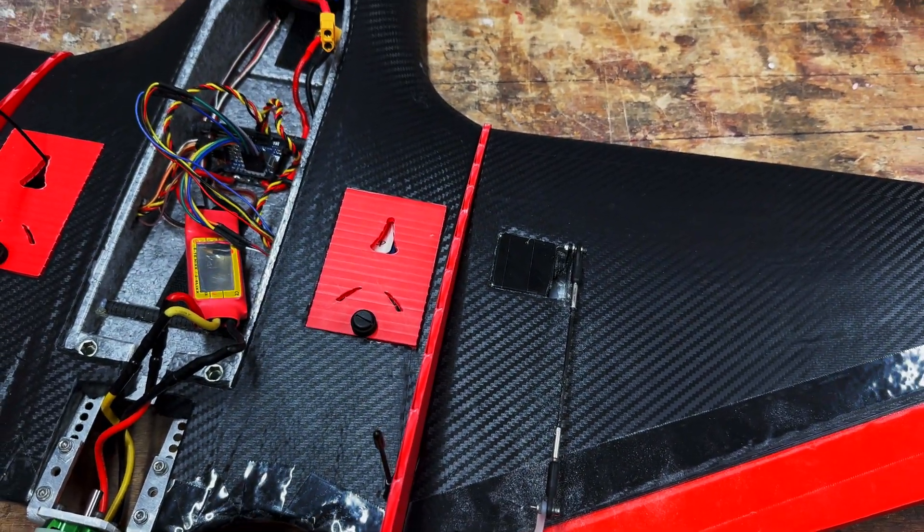We can move it forward a little bit — it'll fit and can sit over this bar slightly. What we need to work out is the wiring. I'm half tempted to rotate the motor 90 degrees so the wires come out and run up and over the arm. As we run the wires across we can loop them in. These wires are really high-quality flexible wire so we can bend them into position — nice rubber insulation properly stuck to the wire. Once the motor's rotated and the wire routing confirmed, I'll trim the wires to the flight controller down as they're massively too long.